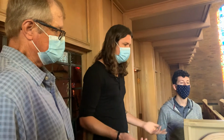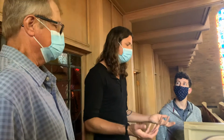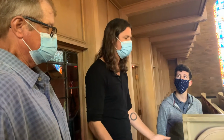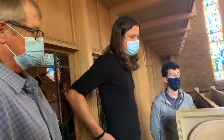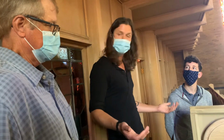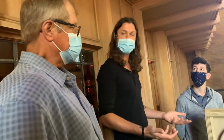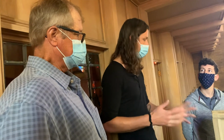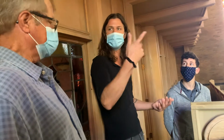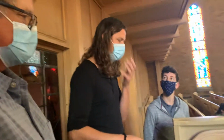But I mean, I don't know. I haven't really heard of very many people blowing anything up, ruining a dynamic microphone with phantom power. They're built pretty rugged. The only real thing that you need to worry about with phantom power, and I don't imagine that you guys would ever run into this situation, but just for your information, is if you have really old microphones like ribbon microphones, which were the original studio microphone, phantom power can blow the ribbon. That's because phantom power came after, so they're not really designed to tolerate it.